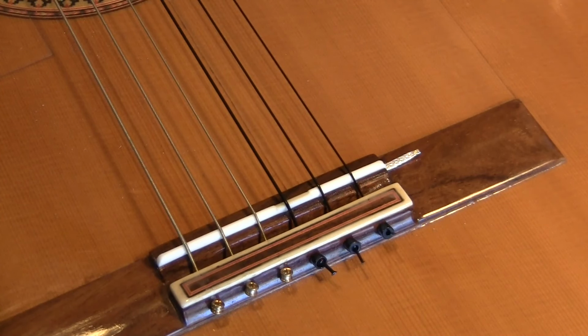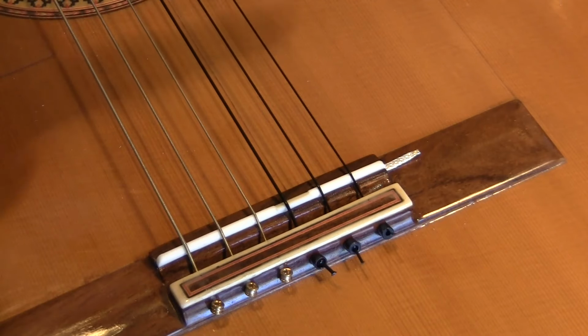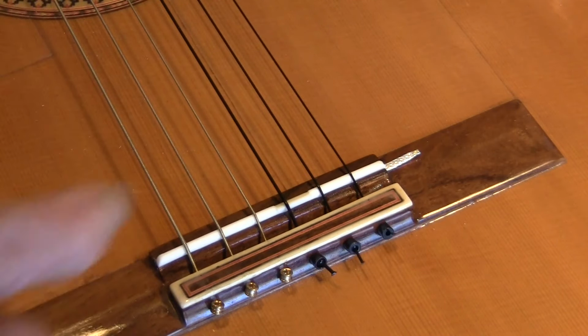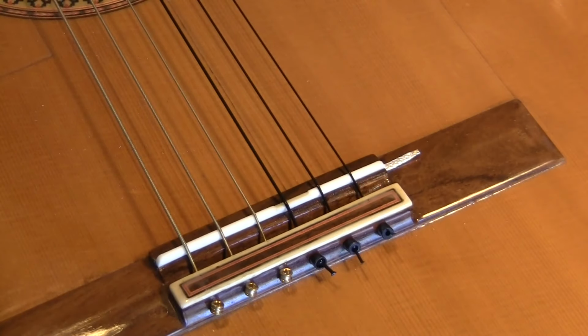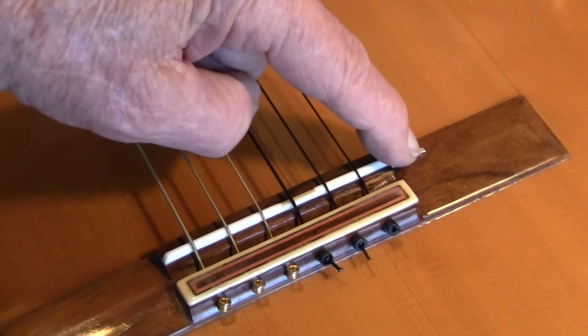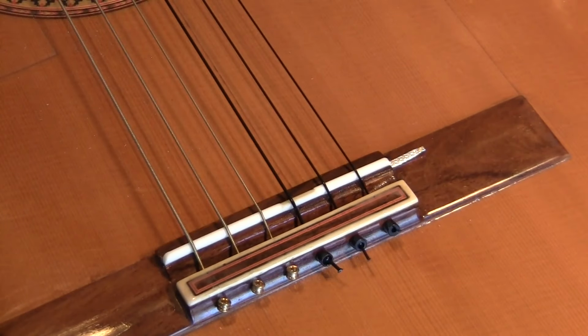My theory is that the solder crept up and interfered with the insulator. The insulator is the transducer. It's most likely Kynar, PVDF. So it's just a length of coaxial cable. So I pulled it up through more and let it stick out the end here, put it back together and got rid of the dead spots, and it's now really nice and even and much more powerful on these two strings than it was. But this is still active and you can't have it sticking out.